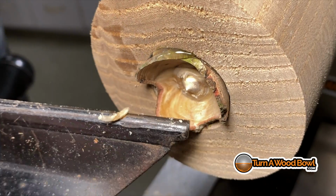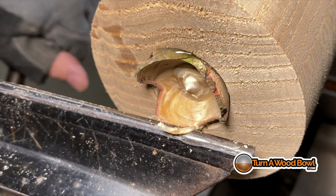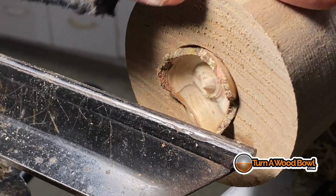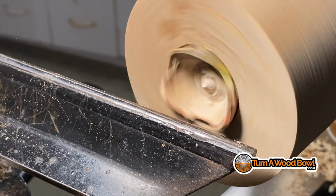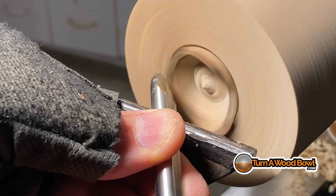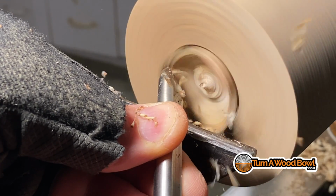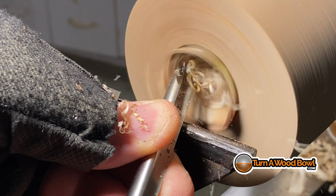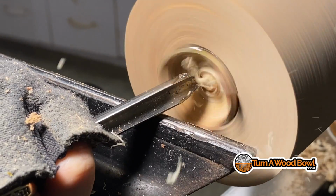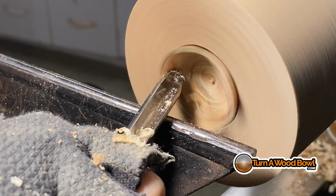The shape's looking really good. We're getting close. Going to make it a little bit thinner. Again, I'm taking the bevel edge and I'm lining that up parallel to the exterior of the bowl as I make the push cut in. And I remember the shape of the bowl, and I believe that I'm mimicking it as close as possible here with the interior.